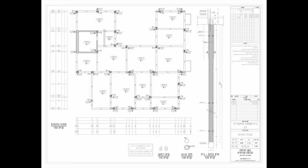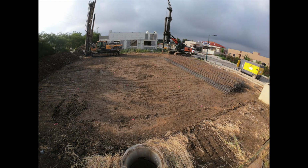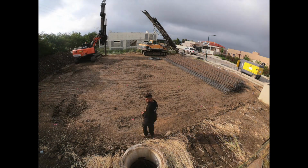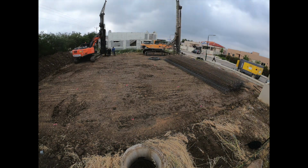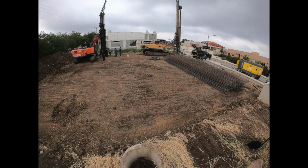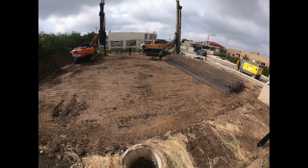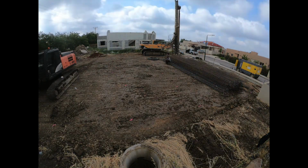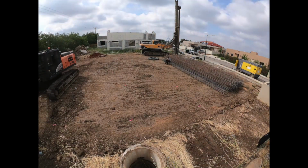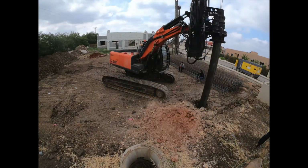And on the right side, you can see the actual spec for the metal pile, and then on the right side here at the build site, you can see them laid out already. He specifies the distance between the round metal as it loops around the long pieces of rebar that will go down into the ground. This is day one of the dig, and we actually ended up having two drilling rigs. One of them is for dirt, and that's what you see here digging.